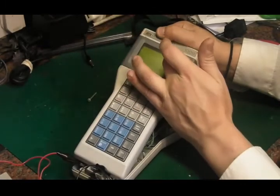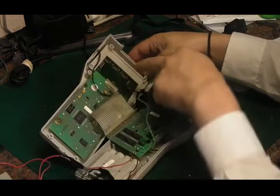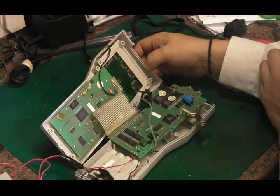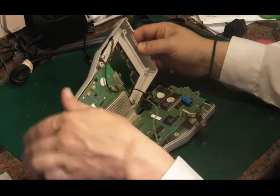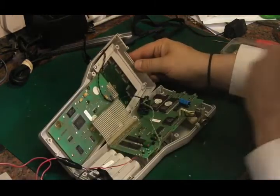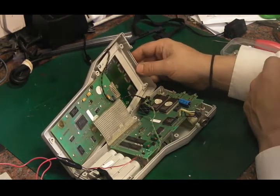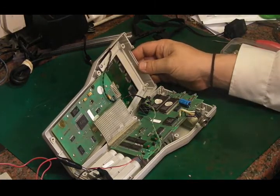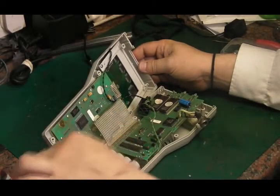Because when you click the power off and the power dies away, for an initial second you actually do see the text. It says testing. So you see it there again, and then, like I said, the screen goes blank. So there's obviously an issue with the screen in there, the driver board, and I'm not 100% sure what. I suppose I could crack into it and see if I can find out what's wrong with it. It shouldn't be anything too taxing, I shouldn't think. Probably not for this video, to be honest, because I literally just wanted to have a crack inside this thing and see exactly what it was.